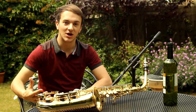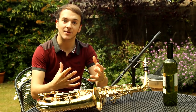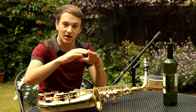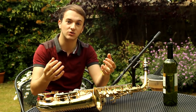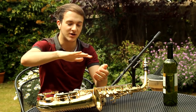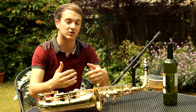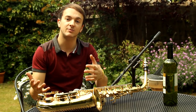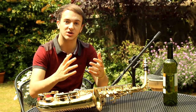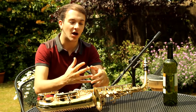The first type of box I'm going to talk about is a sealed box, which is basically acting like a drum. The drum has a skin which moves and a cabinet, and the lowest note a drum can play is determined by the size of the drum and the skin — how tightly you tune the skin. A sealed box works similarly: it's determined by the size of the box and mainly the resonant frequency of the driver. The bigger driver you use, generally the lower resonance frequency it has, so the lower notes you can hear. So that's sealed.